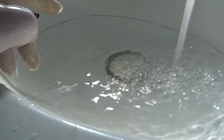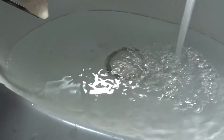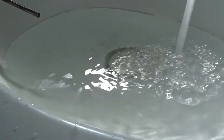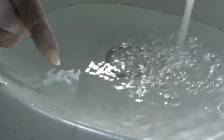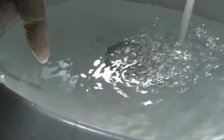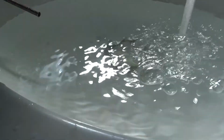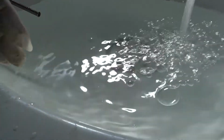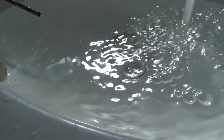And what I'm saying is, wherever this pipe comes down outside in the drain, because this runs into your bath drain. Like, your hand basin runs in your bath drain, it goes out into a drain outside. You need to find the pipe where it runs out into the drain outside, because all this stuff that's come out of this hand basin here, or out of your kitchen sink, is going to be laying in that drain. So what you have to do is take the cover off the drain and hose all the crap out of it, because otherwise it'll smell. So when you're doing it in here, that's what you've got to do outside. You want to do it anywhere it's come out, and hose it all out, and you don't get no smelly odour outside or anything.